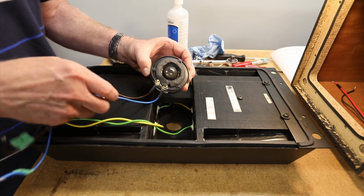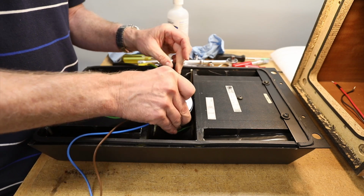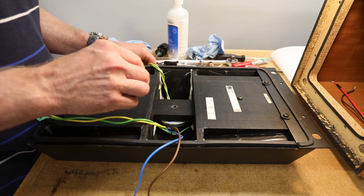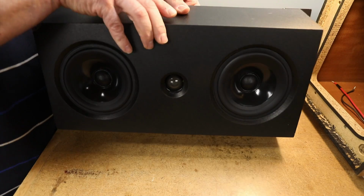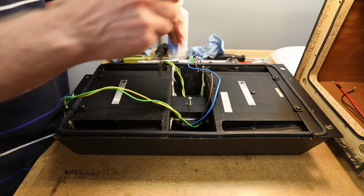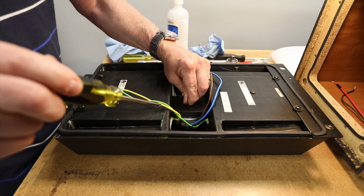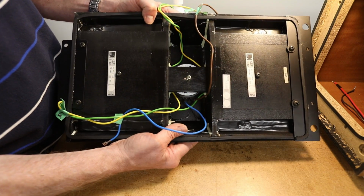The next step is to install the new tweeter. You can stick a piece of gum tape on the back of the tweeter to give the screw something to grab onto. As you can see, the sliding wood block effortlessly slides over the top of the new tweeter. Reinstall the screw. Now it's a simple matter of centering the tweeter in its hole and torquing down the screw to firmly hold the tweeter in place. There you have it. The new Morel tweeter is installed.